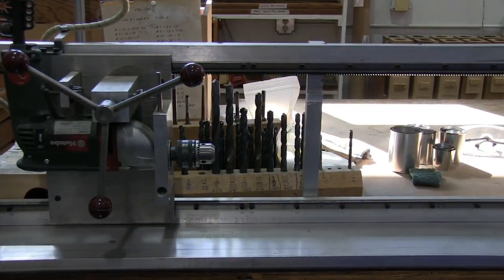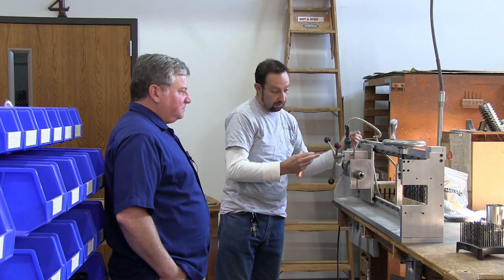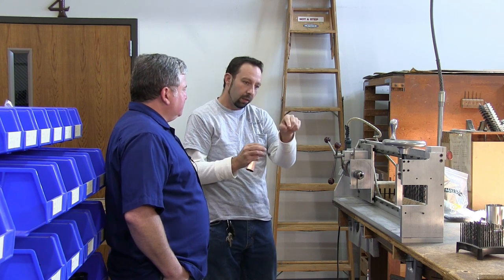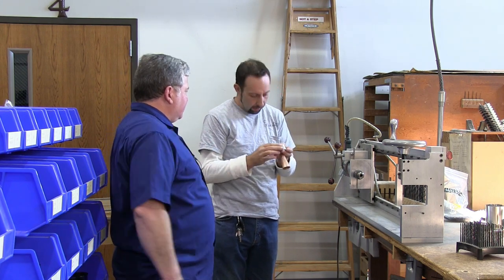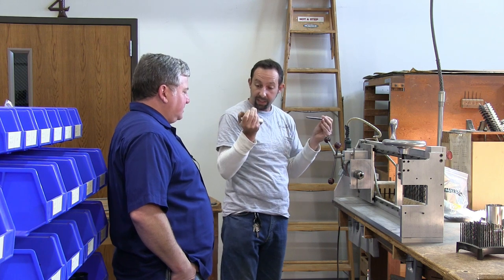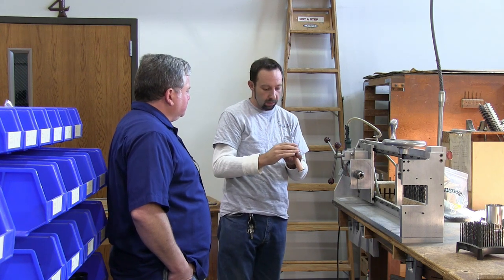And we have some reamers based on which set we're doing. We put it in the drill and just continuously open the hole until the shallot drops down just at or beyond that. The hole is tapered like the shallot. Yeah, and all of these reamers are tapered. This is not. So once you get it into that set-in point, then your hole is good.